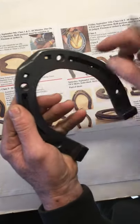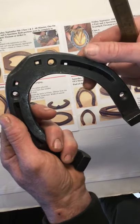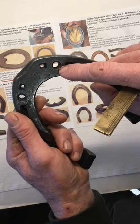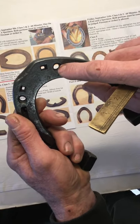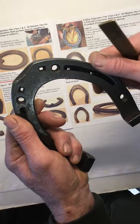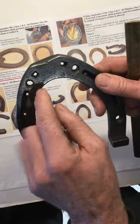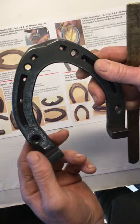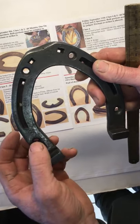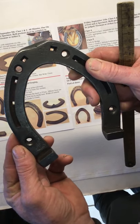The stud holes all have a little bit of chamfer on them. The way the stud holes will be judged is you've got to be able to drop a 5/16 drill bit through the hole, but a 3/8 cannot go through the hole. So for all four holes, a 5/16 drill bit — we'll just cut a drill bit off — it's got to be able to drop through. That's the same size as you'd drill and tap for most standard drill and tap.